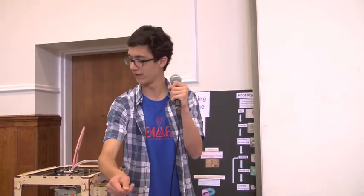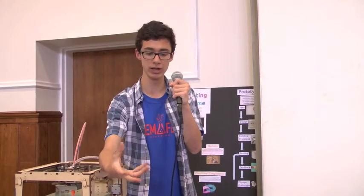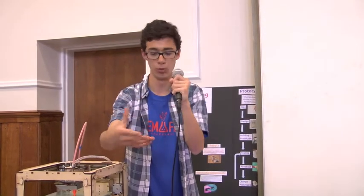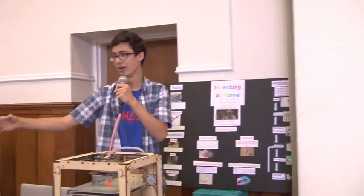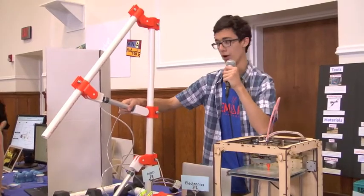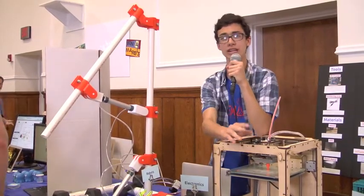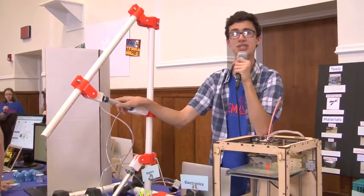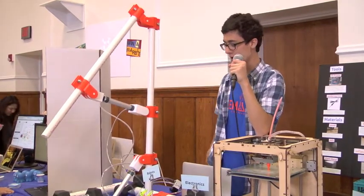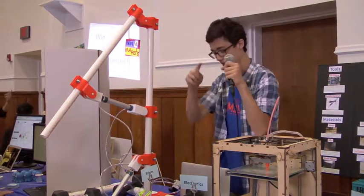The applications for technology like this, for example, are grasping unusual objects. We cannot create a simple claw grabber for robots that will work on all objects. It's just not practical. Now, over here, the big star of the show that I brought today is a fully pneumatic robot arm. Unlike those which used air but were soft, this uses air and is hard. I have two pneumatic pistons and an air compressor and valves. Let me show you what it does.